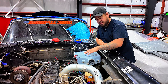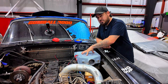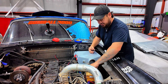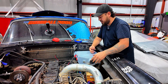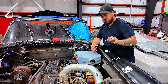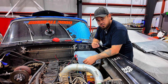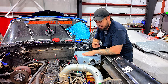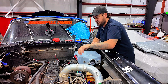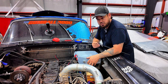I trimmed out the inner fender and I had this pretty stable — not anymore. So what I'm going to do now: there are three mounts for this intercooler. I'm going to use this welding rod and make some temporary mounts out of some aluminum I have to hold this in place, then do nicer ones later. That way with this in place we can connect it to the rest of the system on the engine.